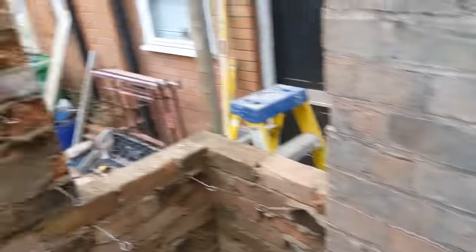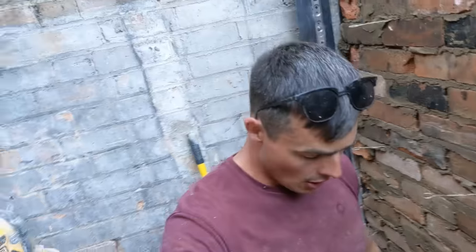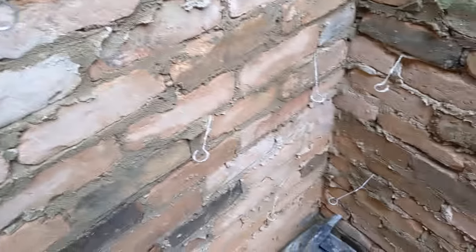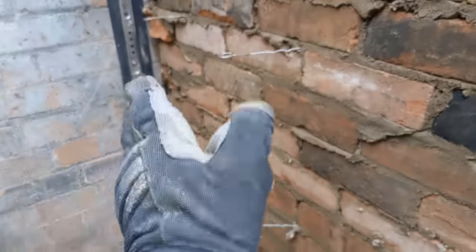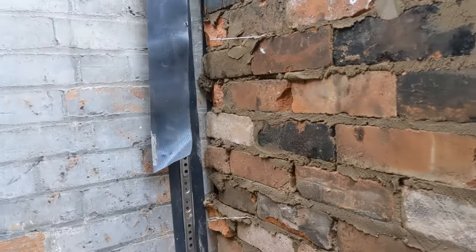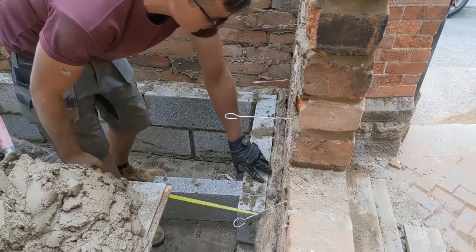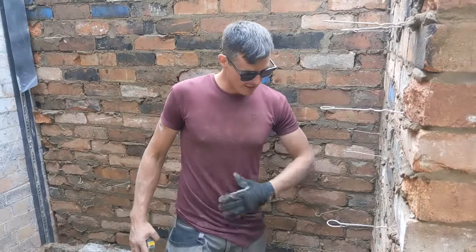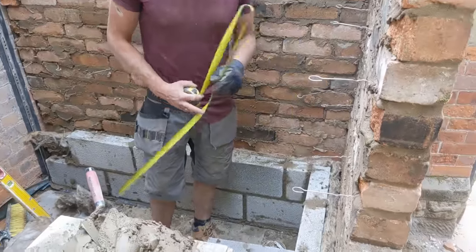It's just gone twenty past two and this is where we're at: all our brickwork is pointed up to roughly steel height, which is pretty good. We've cleaned up the entire area and now I'm tackling all the blockwork — starting here and making my way all the way around. We've got about a 70mm cavity here, it's pretty much nine inch. This whole building is going to be tanked and battened out, and I've already put all my vertical damps up to prevent any penetrating damp.